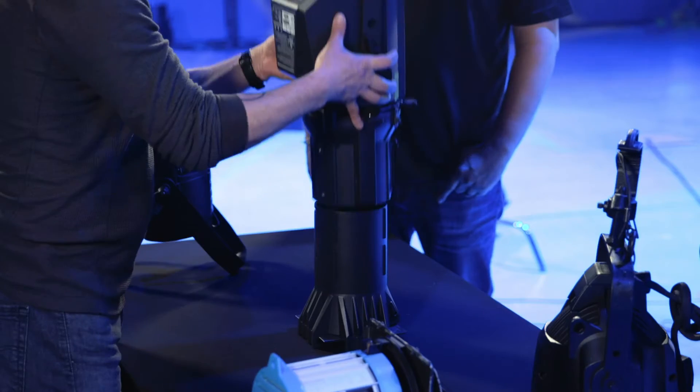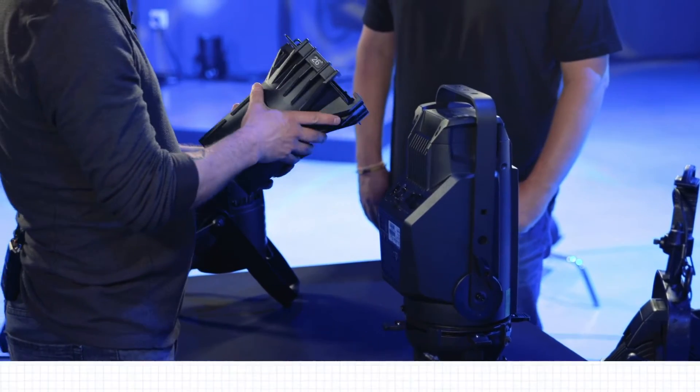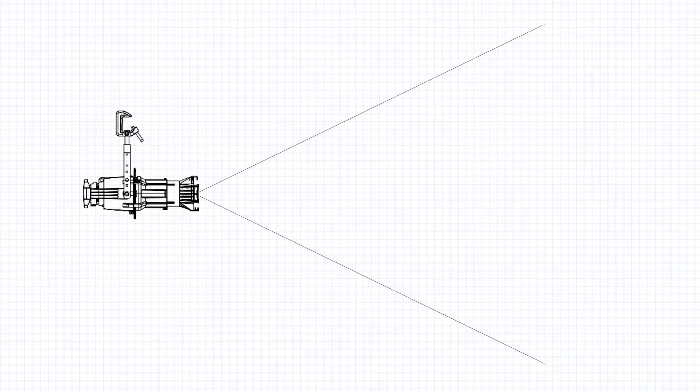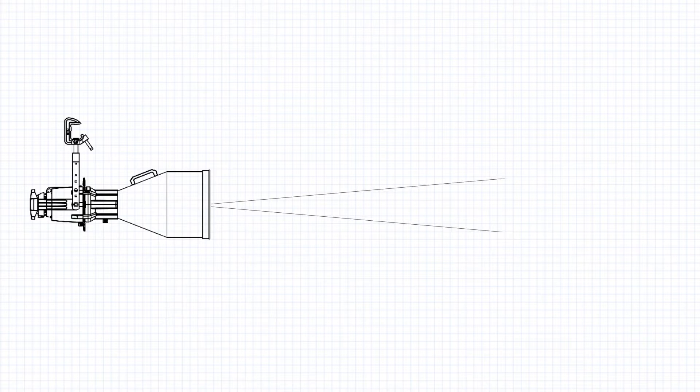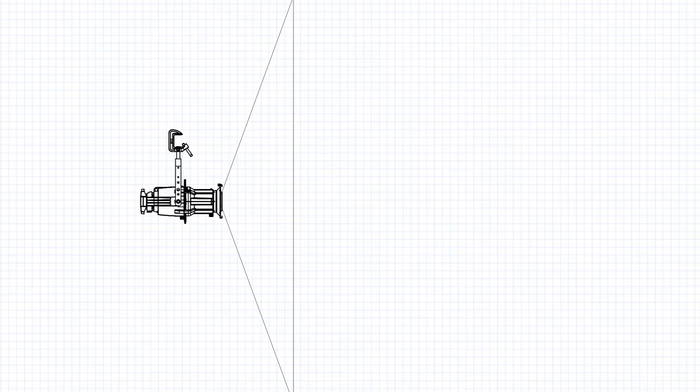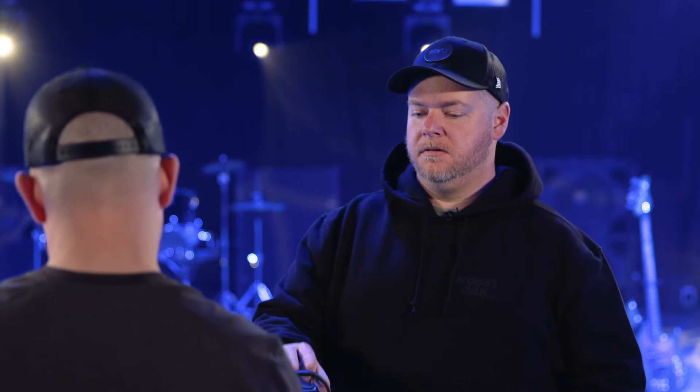The other part that makes an ellipsoidal an ellipsoidal is the lenses on the front — they're interchangeable. I'm going to pop this one off real quick; this is a 26-degree lens. The degrees have to do with the cone of light as it goes out. There's an assortment of different types, from five degrees — used very far away to shoot with minimal spread — all the way up to 90-degree lenses for a massive spread. This matters depending on whether you're close to your subject or farther away and need to retain light intensity.